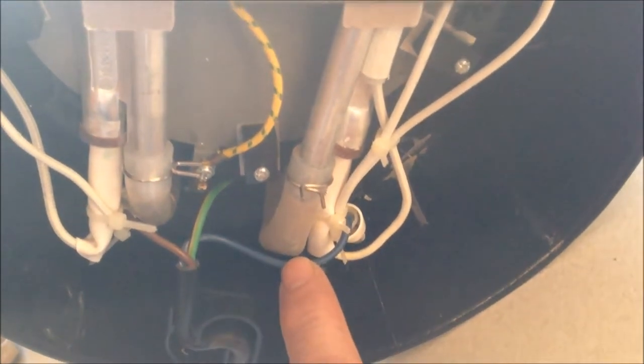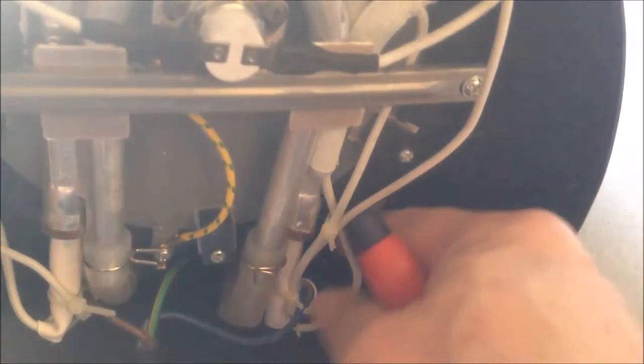So that's the complete circuit. There's another circuit, which is this wire. This wire is directly connected to the neutral, and connects to the switch at the right connector. So in the switch, when you switch on, these two will be connected. When you switch off, they're not going to be connected.